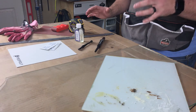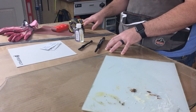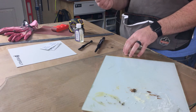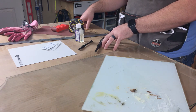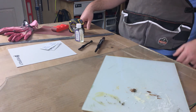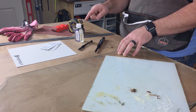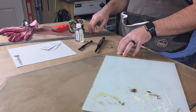Some things you'll need. First off, get a piece of cardboard or cloth or something to put down on your work surface. This just protects the glass and spreads out the pressure, so if there's a little bump on your surface, that pressure won't be pushing in just one spot on the glass. It provides a little cushion and safety. The next thing you're going to need is something to mark on the glass with — this is a long nose pattern marker by FastCap. The next thing is a glass cutter and some cutting oil. Cutting oil is probably optional; you're not always going to be able to find oil with the cutter, but you can probably get the cutter at any home or craft store.